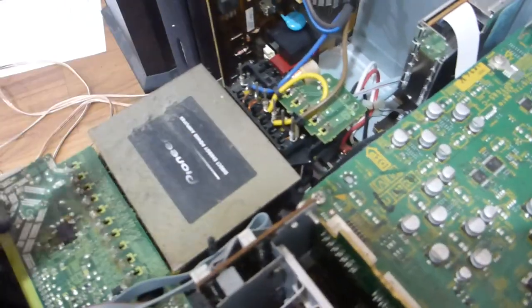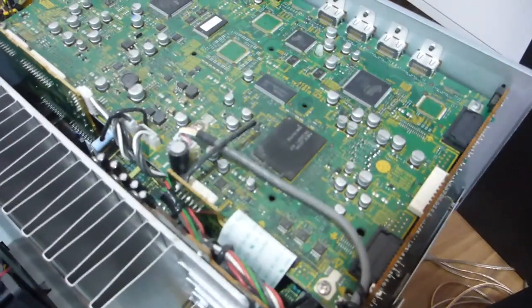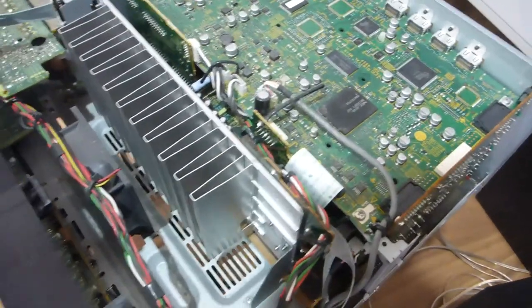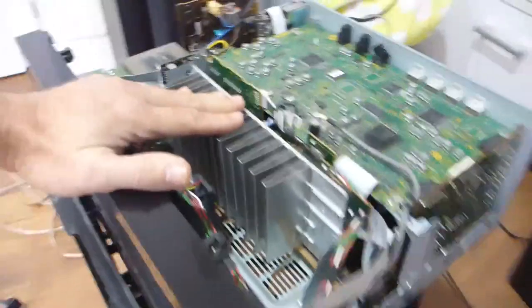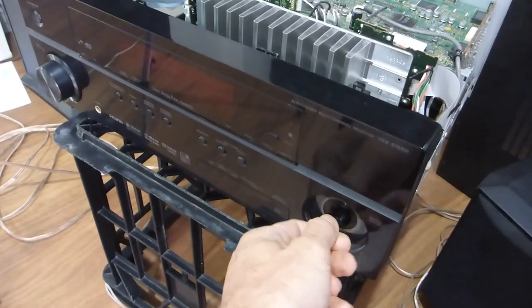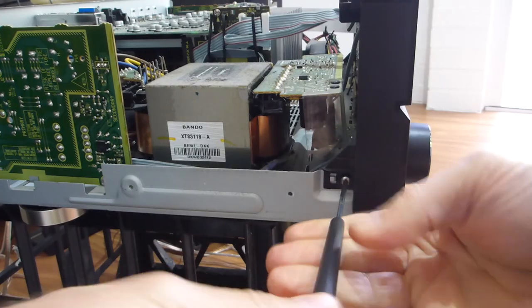Pioneer's direct energy power amplifier — audio encoding chips, NEC decoding chips, a few other bits, Dolby DTS chip up here. This is where all the magic happens, and as mentioned there's a cooling fan — quite unusual but it is seven channels at 120 watts so it has a fair bit of heft. The volume just doesn't work so it's totally useless.